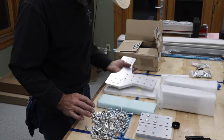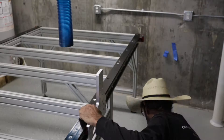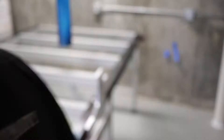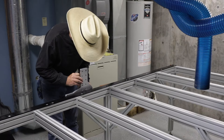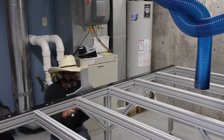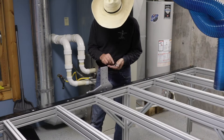Next thing to do is the riser plates. These are some nice looking pieces — big solid aluminum — and they're going to take a lot of socket head screws and T-nuts. These thread right into the linear bearings and I use Loctite. There are four screws on each linear bearing, and I put these on both sides. You can see they're kind of L-shaped — you face the L towards the front of the machine. I'm using Loctite on all screws at this point.